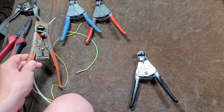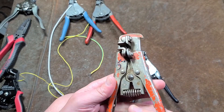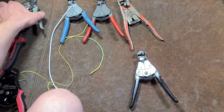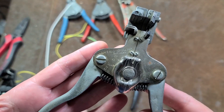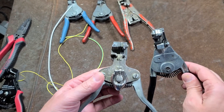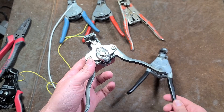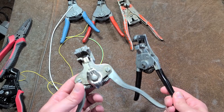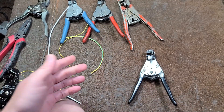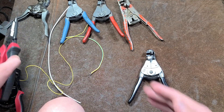These are counter-bore dies that ensure exact centering of the wire. Ideal has made these for a long time — I believe these were the first style of reasonably working automatic wire strippers, before they were called Stripmasters. In my experience, the GC SpeedX Trigomatix are actually the best ones, and I believe the Stripmaster style came out to get around GC's patent. They had better salespeople, so that's why Stripmasters are really so common, where in reality the GC ones are quite a bit better — they're lighter weight, more compact, a really elegant design.